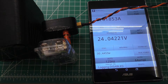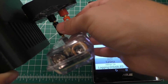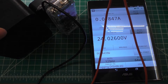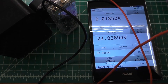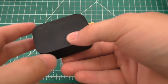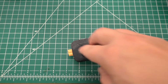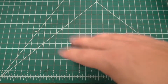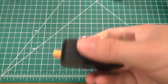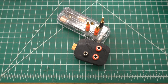It does add quite a bit of height to the meter — I wish it was a little bit shorter, but it should be just fine. You can still swivel the meter while it's hooked up. If you want, you can take another set of banana leads and hook onto these leads to tap out another voltage measurement, or actually inject voltage into it at that point. Overall I think that turned out quite nicely — it should be much better than running leads for the meter all over the place. It's versatile: you could take the meter off, put a shorting block in, or hook up a different meter with banana jacks. That should make a pretty useful little tool.